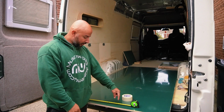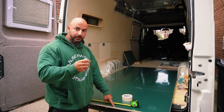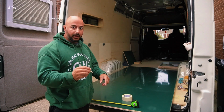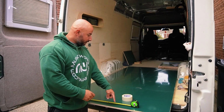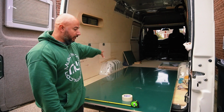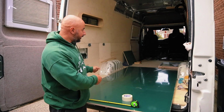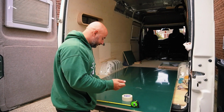So we'll scribe onto this, from the wall onto this at 70, so that's where the cut starts. So that's the longest part, and then it'll get into that arc and it should fit nicely in. So we're going to chop off at 72 a big length that way, and then we'll cut off the top at whatever the height of the ceiling is, and then we'll put that piece in, then scribe, and then use the jigsaw to go around it.